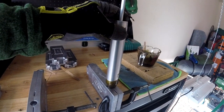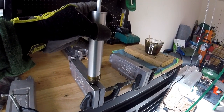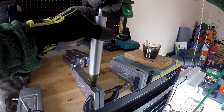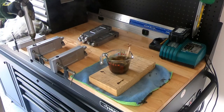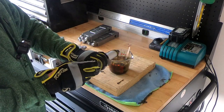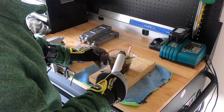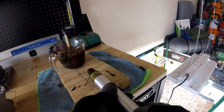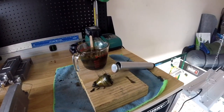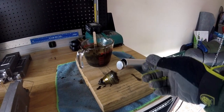Suck it in there into your injector. Push down gently — you don't want to push a lot of pressure against it because you don't want the hot plastic to come shooting back out at you after you take the injector off. Then what I do is put the extra stuff back into the Pyrex container. Pop the cap off and let it cool, just so the O-ring doesn't prematurely wear out by having 380-degree plastic on it longer than it needs to be.